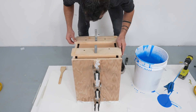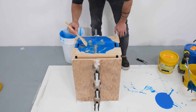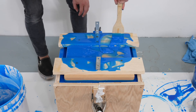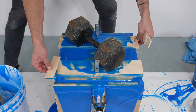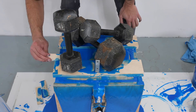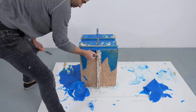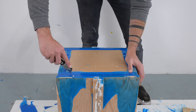I filled the mold a little less than halfway, placed the prototype on top, and then poured additional silicone around the edges. MDF is pretty heavy but it's not as dense as liquid silicone and the prototype started floating up on me, so I put a couple of weights on it. I realized I had over-poured a bit — actually more than a little bit — but the silicone peels off melamine quite easily. Once cured I used a knife and chisel to scrape away the hot glue and caulk.